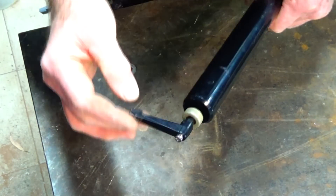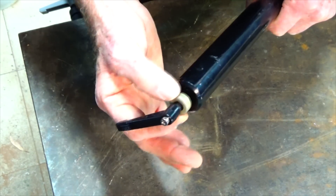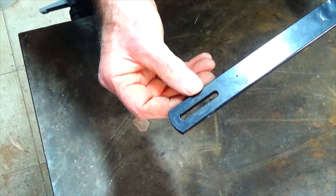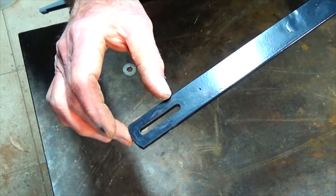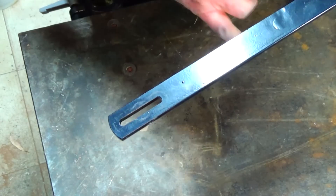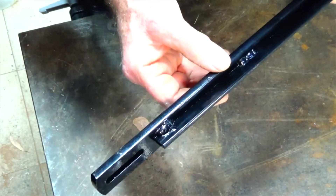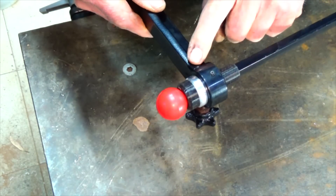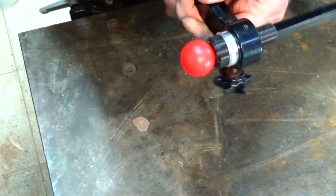At the top end I've got a steel plug fitted into the top of the tubing that's been welded in, and then one of these cheap little levers with an M6 thread on it and a big flat washer to hold the arm and stop it from pivoting or rotating. The arm has a slot at one end — that slot doesn't need to be very long, it's just to give you a little bit of adjustment so you can line everything up and make sure you're going to get the screw end into the pattern. It's got a piece of steel bar stock welded on to give it a T-section just to make sure it's nice and rigid and won't flex at all.